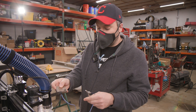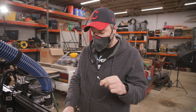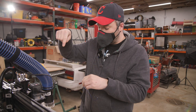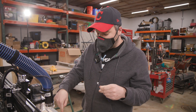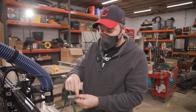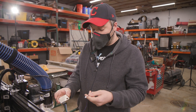What this does is use a little conductive plate, and you attach one end of the lead to your bit. When the machine detects that there is a connection between the router bit and this plate, it says 'okay, I found it,' and the machine will go around — it knows the dimensions of this — and will find all the corners. So it'll set X, Y, and Z just by setting this on there and telling the machine to go.